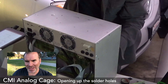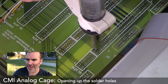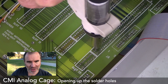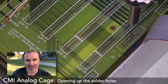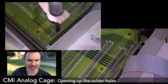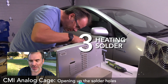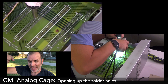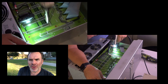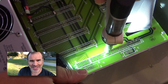The more I'm working on this, the more I'm realising that there's a lot of small repetitive tasks to do. All this desoldering and soldering, it's going to be a while. Who knew there'd be so much desoldering? That's okay, it's part of the journey. I've got to desolder these holes. As part of the manufacturing process, the solder just kind of flows over and fills it all up, so that hole has to be taken out. I've got a solder vacuum gun that's basically for this exact task, but the solder on the board is about 30 odd years old — it takes so much time to heat it up. Anyhow, as you can see, this takes time.